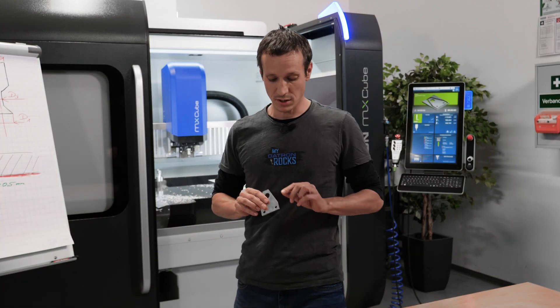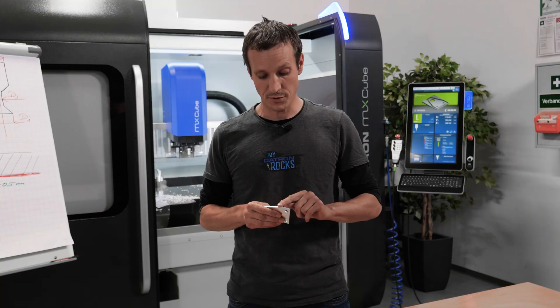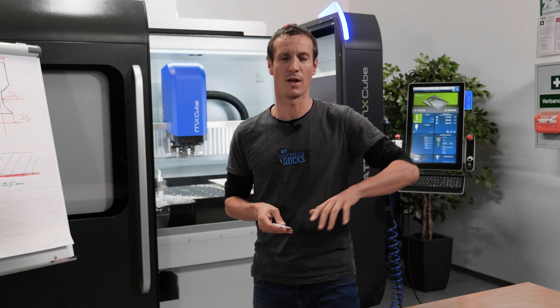Our part is finished — we have smooth edges and chamfers on all sides, top and bottom, 0.3 millimeters in our case. The tabs are necessary and recommended when you have very small parts; for larger parts where there's no risk of flying off the vacuum table, you can cut them out directly and then use the dovetail for creating the chamfer. We've put the CAM file and the milling file in the description below as a download link so you can get a better insight into how we programmed and milled everything. If you have any more questions about this technology, Datron milling, the software, or anything else, just let us know. Thanks for watching — hope to see you soon!